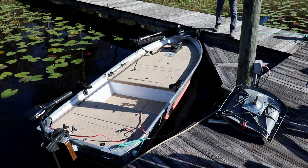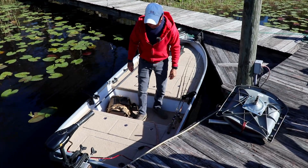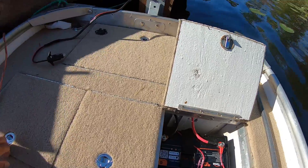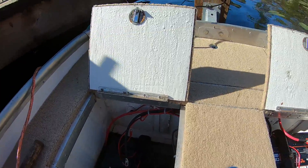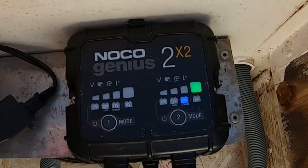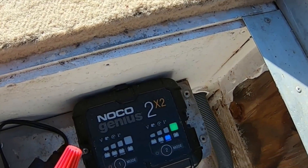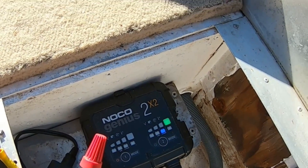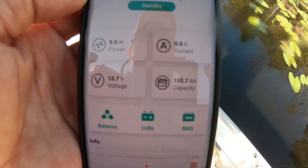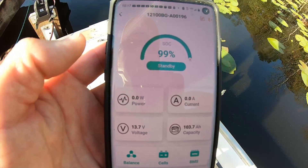My long lunch turned into an all-day affair — it's now the next day, but a beautiful crisp sunny day here in North Florida. I already installed the battery right here, and on the other side where my other battery would go, it's empty. The charger is set to lithium and it's showing completely full. Let's see what the battery says: linking up with the battery, it's showing 99% and I've got 103.7 amp hours of capacity — a little over 100%. It looks like we're not getting any charging current from the charger, so I think we're ready to go.